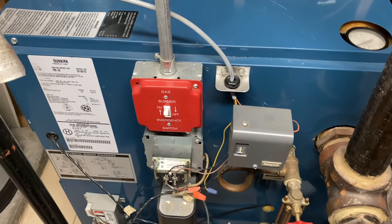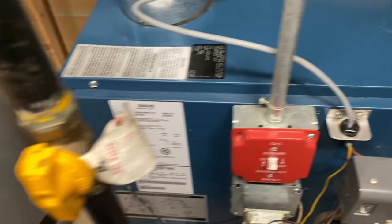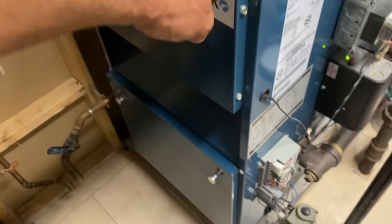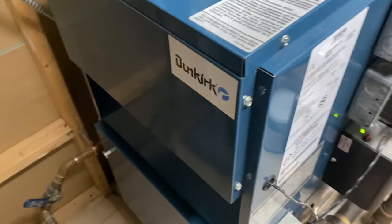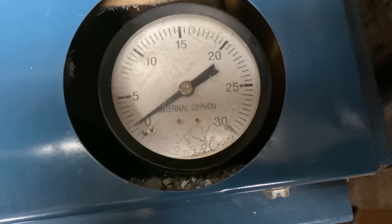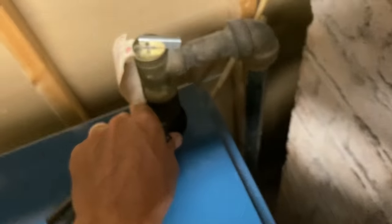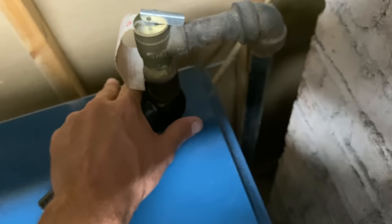So it's been about 3 minutes. We already hear steam being created. The water's boiling already, so you can hear that. I hope that's not indicative of other issues. No, I don't see any rust, so I don't think we have any cracks in the heat exchanger or holes in it. That's a good thing. We're gonna keep an eye on the sight glass and also the pressure indicator, which is reading at 2. So far, so good. I feel a lot of heat coming out of here, though.